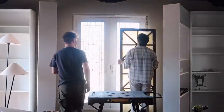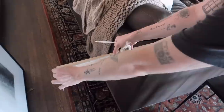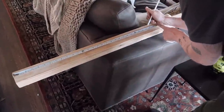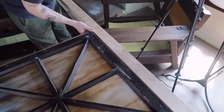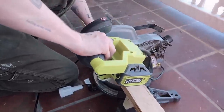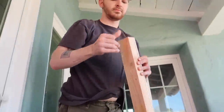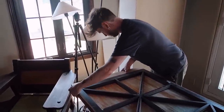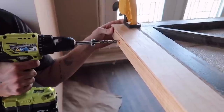I do have to add about two inches of wood to the bottom of the door as well, which I want to try to match up to the stain that's on there. The stained glass doors were the proper width but not the proper height, so I actually needed to add some wood to the bottom. I wanted to make it look seamless. I just measured out the width of each door. For the wood, I used a 2x3 piece stacked with a quarter-inch piece on top, sandwiched together with wood glue, pressed for a couple days, then cut down to the width of the door.